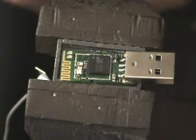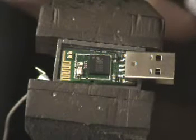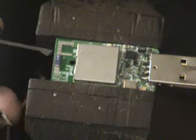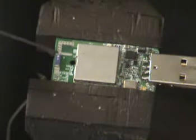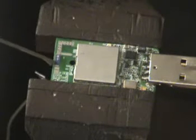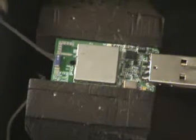Usually when you buy a USB wireless stick, WiFi or Bluetooth, you don't know what you get until you've actually purchased it, unless you can get the FCC ID. If you remember in previous segments, I've used the FCC database lookup quite a few times to get internal pictures of USB adapters before I purchased them. Here we have the internals of a very generic $11 or $8 USB WiFi adapter based off of a Zydas 1211 chipset. Over here there's this ceramic inductor — an inductor is a coil of wire, and this inductor will actually take the place of that coil of wire that was on the printed circuit board. This is a very poor antenna. This is the signal wire and it leads straight up to an inductor, which fools the card into thinking that there is a set amount of wire.